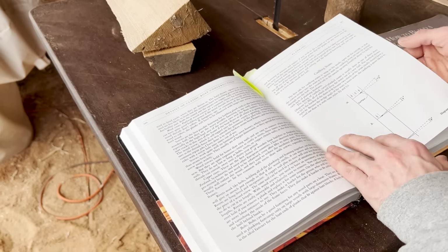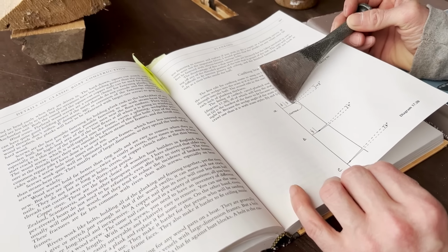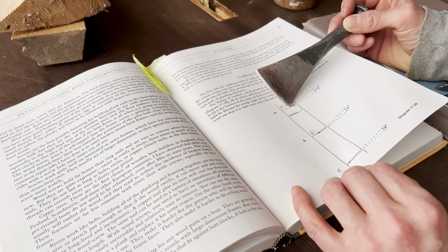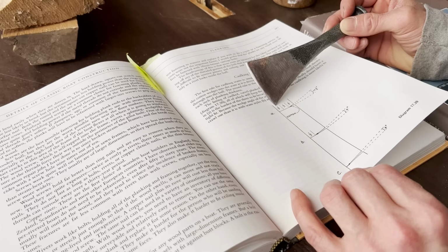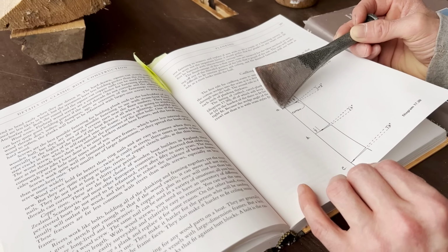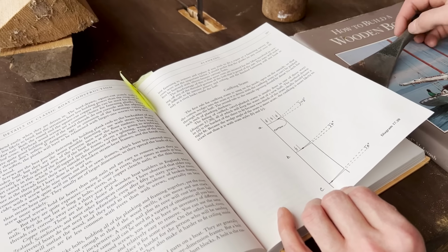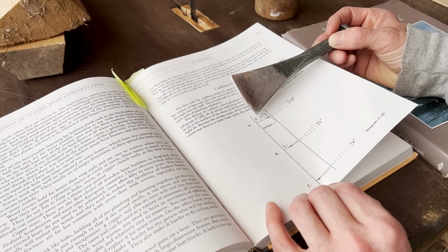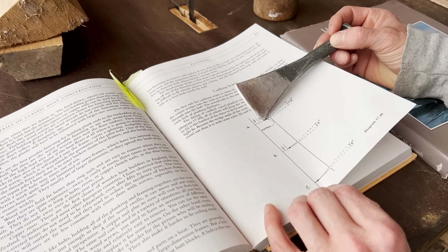What Larry is saying here is that in seam style A, when this plank and this plank swell, you have great wood contact here, and that swells tight, but it ends up putting incredible forces on the frame, which is right here and fastened through. As these planks swell up and down, our frame, where the grain is running the other way, is shrinking and swelling widthwise. So you have two competing forces here. And if you plank a boat of Arabella's size with dry oak and do this style seam and all of that oak swells, there's no relief.